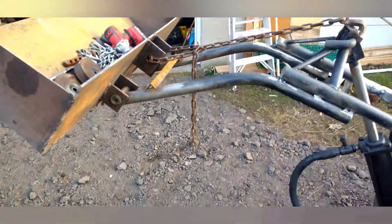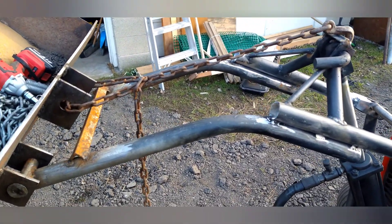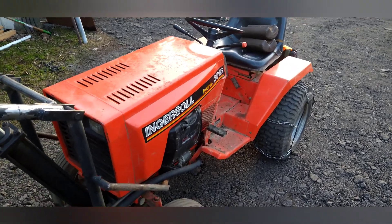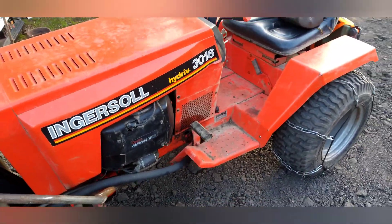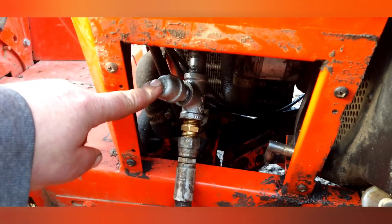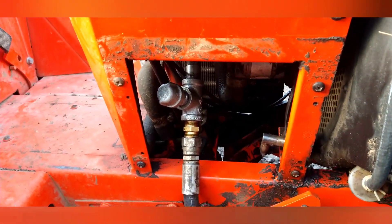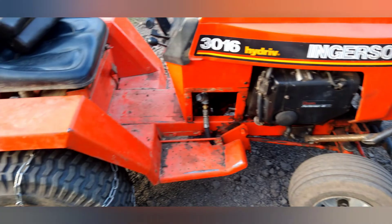Right now I'm just using a chain instead of the front cylinder — I just haven't had the time to put that on yet. That's quite a big project; I've got to mount more hydraulic lever valves up here. I have a couple laying around that I got for free or cheap, plus more lines. I already did my tee — I got some plumbing stuff from Home Depot and teed in with galvanized, three-quarter to half, which I'll use to feed the new valves for that front cylinder.